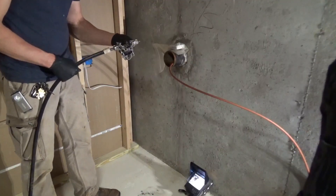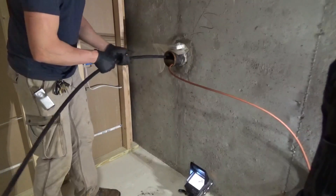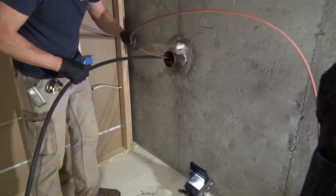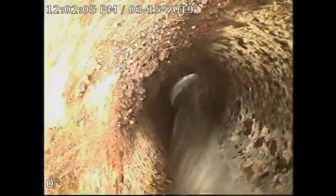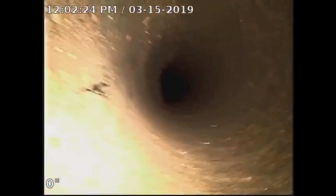We have to clear the texture up the sewer line and get it nice and smooth again, so we use this tool that has carbide teeth on it to whip around and clean up that cast iron pipe. This is that tool whipping around violently, descaling the cast iron pipe. Look how the scale gets knocked off the pipe — it basically just aerosolizes into dust.